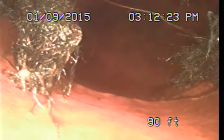The line runs down the street kind of parallel and then makes a 45-degree turn to run over and drop into that public sewer. So here's the area of roots, and it cleaned pretty good. For a conventional snaking through an access such as this and then getting down into a 6-inch pipe, that's pretty tough to do — someone spent some time here and got it cleaned out pretty good. The pipe is draining now, and there are no obvious signs from what I can see that there's any damage. The coupling has been compromised and it's allowing the roots in, but I'm not seeing that anything is actually broken in the clay pipe itself.